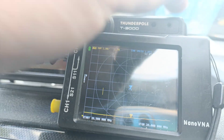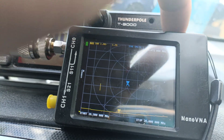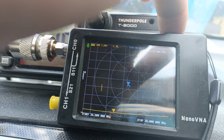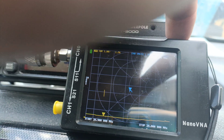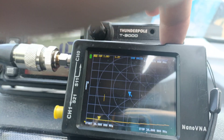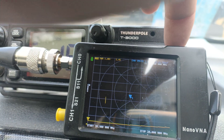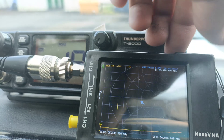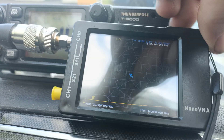I'm just going to have to focus on the screen a bit because it's out of focus. So the SWR's going down. It's biased towards the CB band somewhat, but that, to be honest, is fine. I'm not going to bother trying to get it any lower than that — 1.3, 1.4, that's fine.